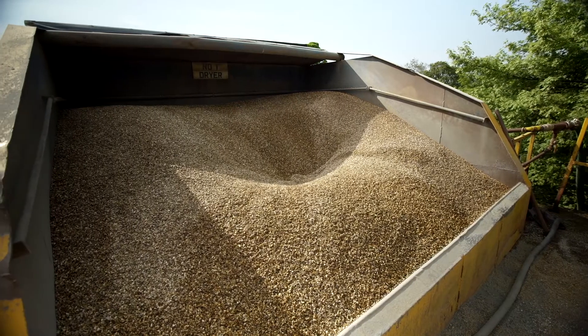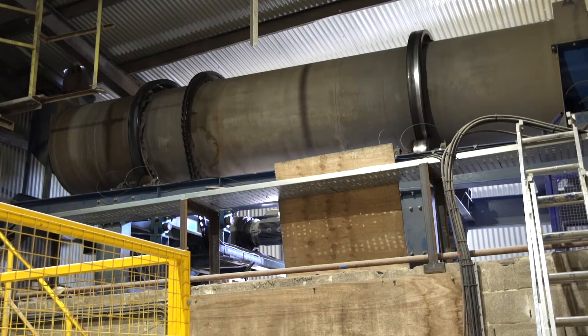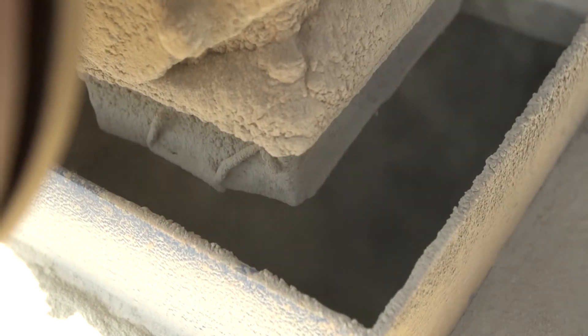The aggregate must be dry. Do not use aggregates that appear to be damp in bags, as the resin may react with the moisture and lead to clouding and patching. Dust can soak up resin and create a cloudy finish.